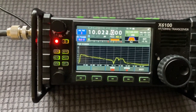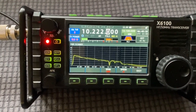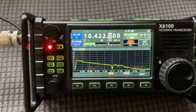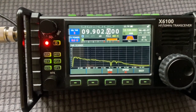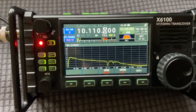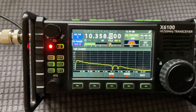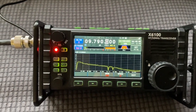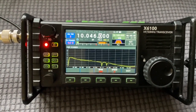I'm on 30 meters because that's what the 20-foot wire says it should use. It's a little high on other parts of the band, so I'm going to probably stay around 10.110 MHz on the 30-meter band — that's a nice dip. I could get it further down the band by making some adjustments. But we're going to try to make a contact here. Stand by — I'm going to get the key out ready and see if I can hold this camera and do some keying too.